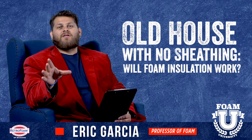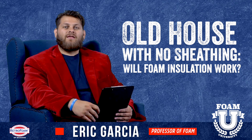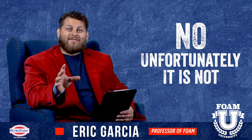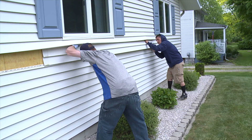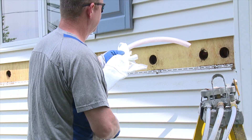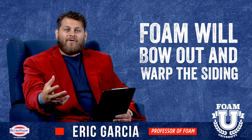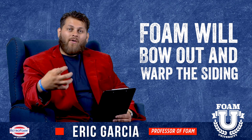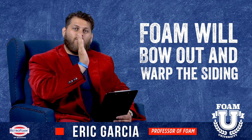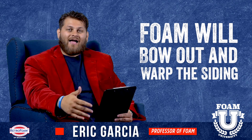So you've made the smart decision: I want to put foam in my walls, but then you realize you don't have any sheathing underneath the siding. Is foam an option now? No, it's absolutely not an option, unfortunately, and here is why. If we go to remove some siding and we realize there's no sheathing, even if we wanted to try to run the hose down every stud cavity and inject foam, what would happen is the foam would bow out the siding. You would end up with a finished product where your siding is really wavy all up and down your walls, and it would look terrible.